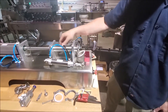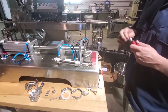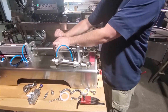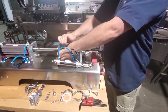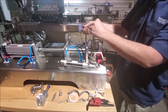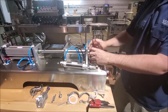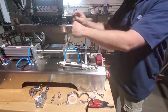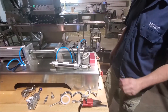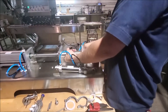The next piece we're going to have to pull off is our product cylinder to expose our piston. That is a six-millimeter Allen wrench for these clamps here. We just need to loosen them up just a little bit — you don't have to take the bolt completely out. Our cylinder should pull out. It could be difficult because of the O-rings inside, so you have to give it a little force to get it out.